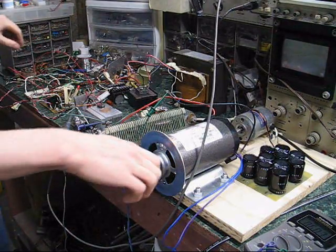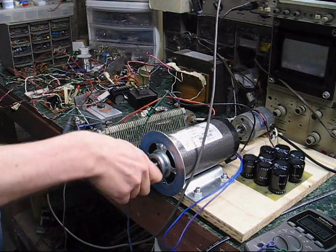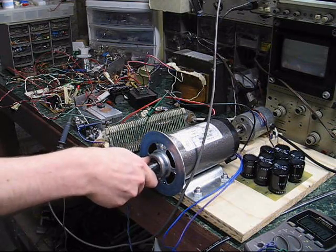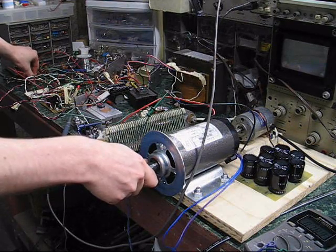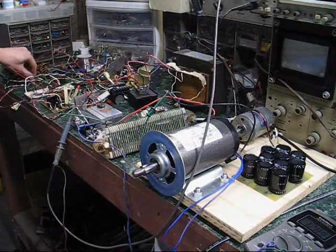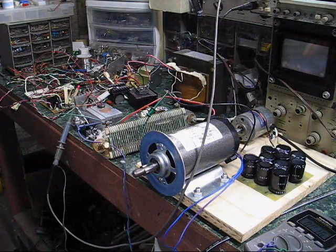There's throttle. I can run it at low throttle — don't really do this. Since it's current limited and running at low current, it's practically constant torque, so it's really easy to stop at this level. Just a little more becomes a lot harder. And when it starts revving up to full speed, I'm not even going to bother trying to stop it — that would hurt.